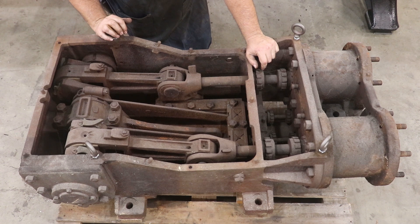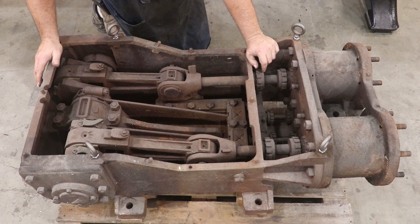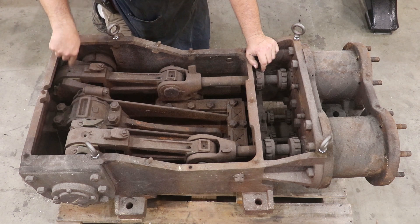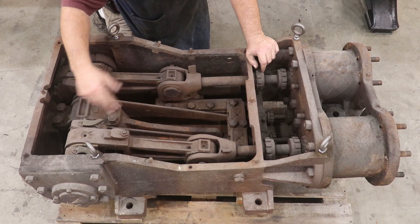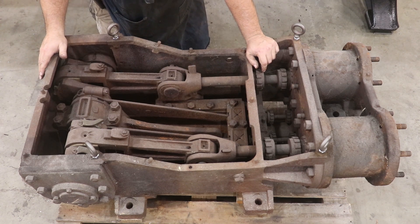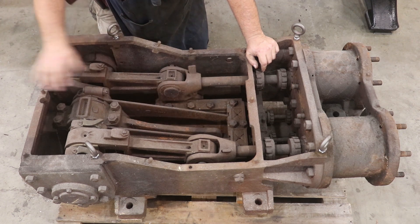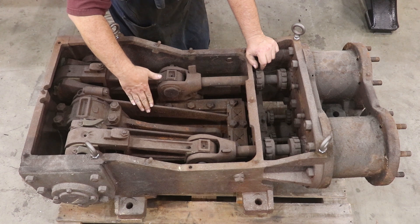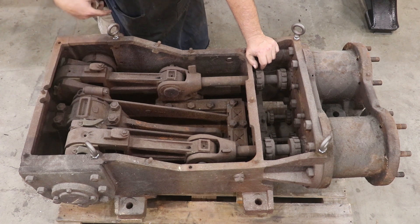In operation, unlike most steam engines, this one actually ran with oil down in the bottom of the crankcase — very similar to a gasoline engine. You have these oil slingers on here, two here and two on this one. When this swings around, the oil scoops in and when it slings back up, it's just splashing oil all over the inside. There's a cover to keep the oil contained and it splashes down into the bearings. These two pieces here are the valve rods that basically turn the valves on and off so that steam is ported to the correct place. Over on the backside there's a big square connector — that's what connected to the drive shaft that powered the auger going up into the locomotive.